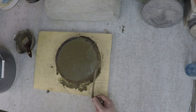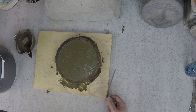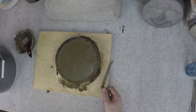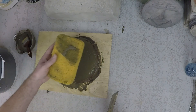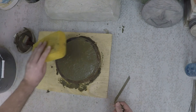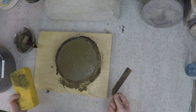Get the concrete close and then leave it. When it's fresh it looks very wet and watery, but in a short amount of time you'll notice that watery look goes away and it becomes somewhat hazy or matte looking — that's the point to get a good finish. You can do so with a trowel or a wet sponge. Use the wet sponge to flatten it out and then a trowel to put a nice finish on it.